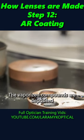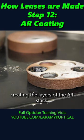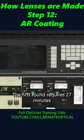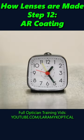The vaporized compounds are deposited, one at a time, on the surface of the lenses, creating the layers of the AR stack. The first round requires 27 minutes per side, or 54 minutes to complete.